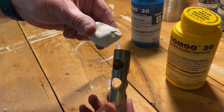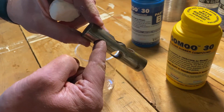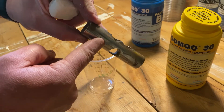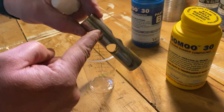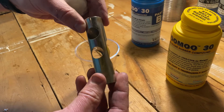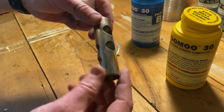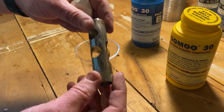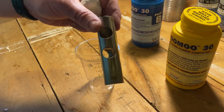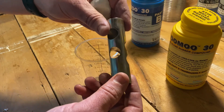What I've come up with is I'm going to take the molding clay and make small plugs that actually go into the middle of the holes. Those plugs will stop the silicone rubber mold compound from going all the way through, and will allow it to just go into the hole on both sides but not all the way through to join. That should allow me to cast it — still having the holes indicated — but without it going continuously all the way through so I can still remove it from the mold. That's at least my concept; we'll see if it actually works out.